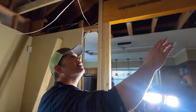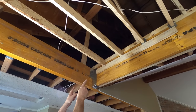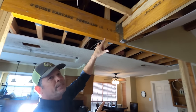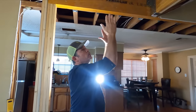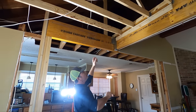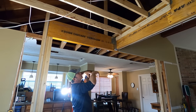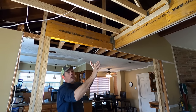So this brace right here is our last one, and it goes up between these two joists. Those two are actually just pinned in place with one screw, so I can take those out and put our ladder back up here for attic access. Once we're all done with the ladder, we'll pull it down, put up this brace, secure those two joists, and we're ready for drywall.